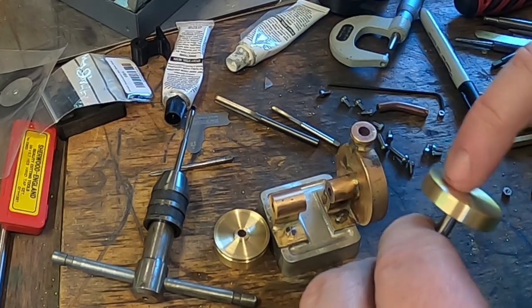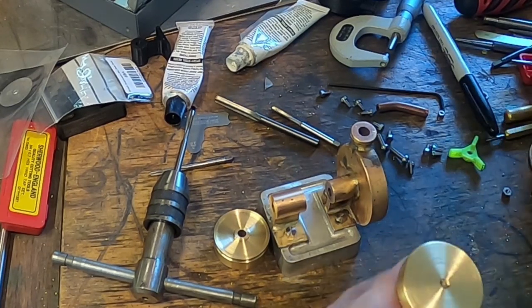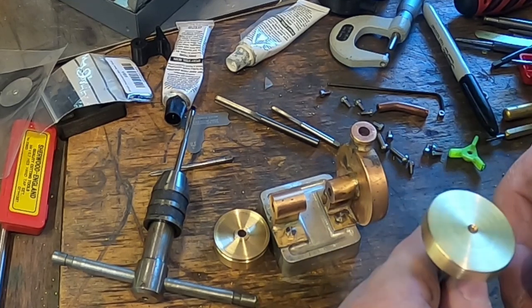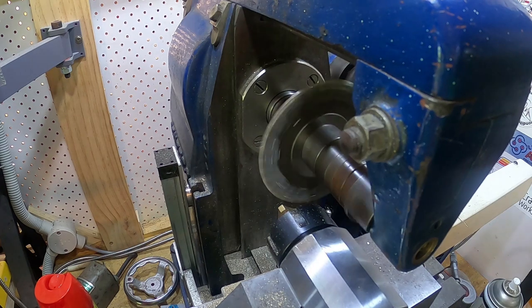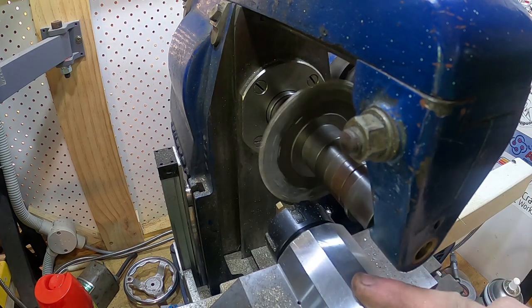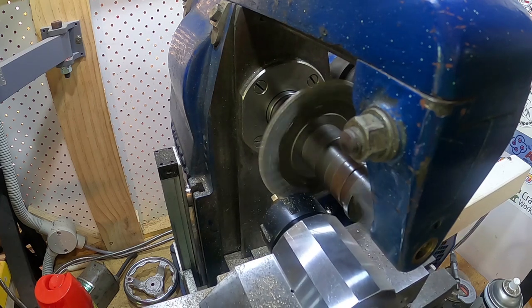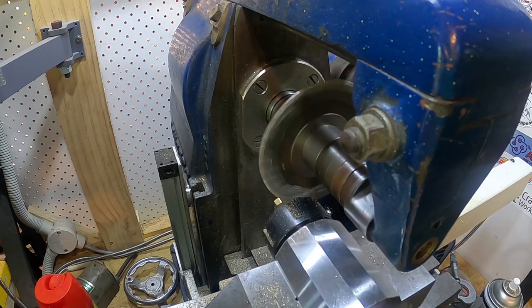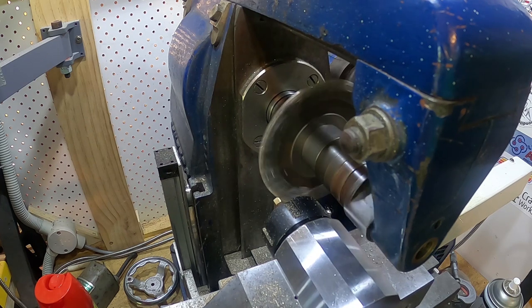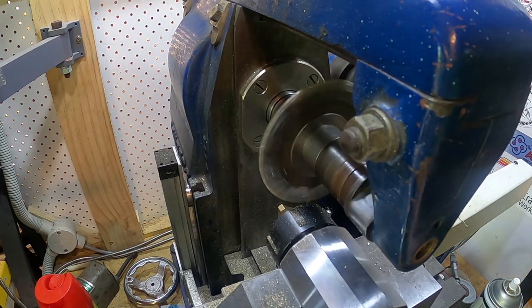So there we go. This is going to need to be bored out in the center, and it's going to need three vanes chopped in there like that, I think is probably the answer. So vanes are next. We better set this up in the mill. Difficult setup this, and I've messed around with it for a bit, but what I've done is just use the collet block here, and a side and face cutter, a fairly sharp one, and a couple of cuts at a time to get this down to the shape that I really want it.